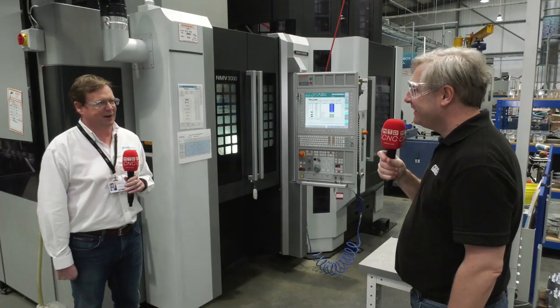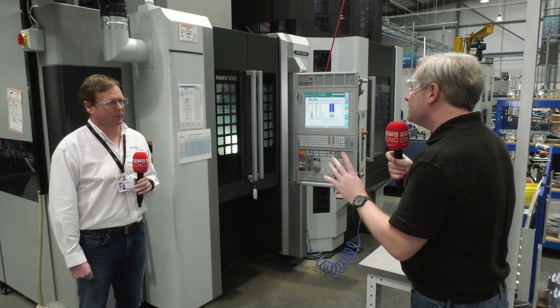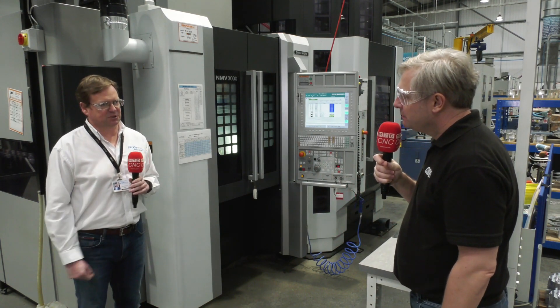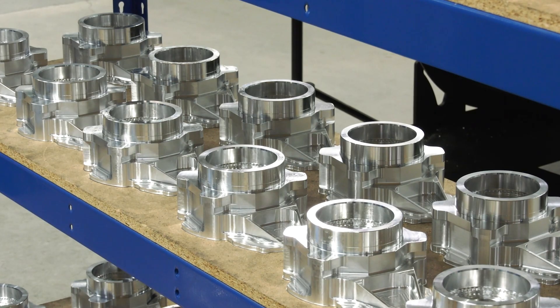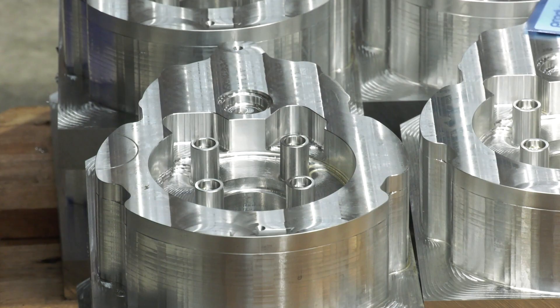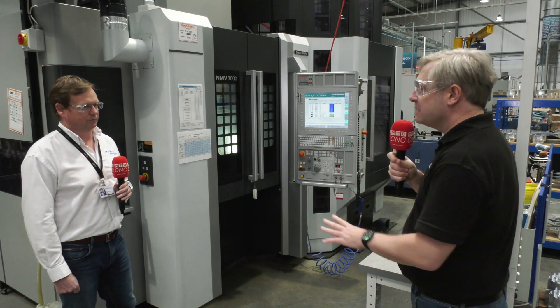You can tell it's aluminium here, but you can take some big cuts if necessary. We cut Inconel, titanium, hard PH steels — very easily. We haven't managed to phase it yet. Now this isn't just a five-axis machine — it's a six-axis machine. The sixth axis for us is the extra turning table, so a mill-turn for Project Max is turning on a milling machine. This has a 2,000 RPM turning table, which allows us in one hit to finish all of the turning and milling operations.